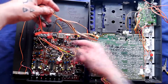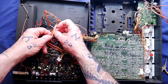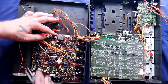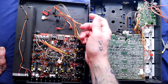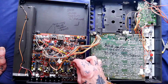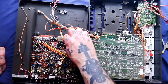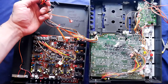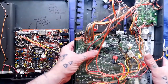Most of these connectors from this corner of the mixer join together around this area. Last of all there's a rainbow-coloured ribbon cable — in addition to brown, red, orange, and yellow there's a pale blue fifth cable — going to a white header between this pair of variable inductors and these relays over here. The reason I'm taking pains to tell you what cable goes where is that it's possible to get these confused. There's a four-pin connector here that I could mistakenly put beside this jack socket, but that's not where it goes — there's another red four-pin header over here by the oscillator, and that's the correct one. If you don't distinguish between the group of cables coming out of one side of the mixer and the group coming out of the other side, you can become very confused during reassembly. We'll come back to this upper half of the case later on.